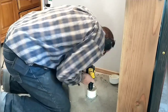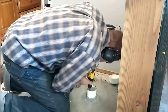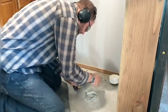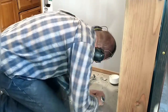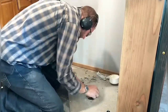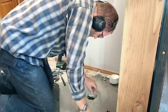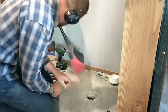At first I had planned to use a toilet flange that goes over the outside of the pipe. Unfortunately, there's not enough of a gap between the concrete and the outside of the pipe to do that. I was really worried because I didn't think they made a flange that went on the inside of a 3-inch pipe. I got online and looked it up, and sure enough they do make a flange piece that fits on the inside of a 3-inch diameter pipe, so I had to make a special trip to town to get one. With the new flange in hand, I'm ready to do my final fit-up preparations — it's a good thing I cut the pipe about a half an inch below the grade of the concrete because I need that room to accommodate a bevel on the inside of the flange.